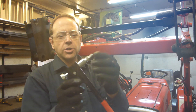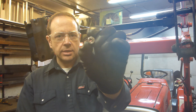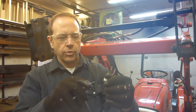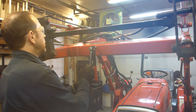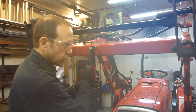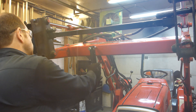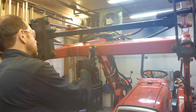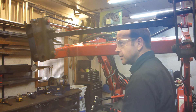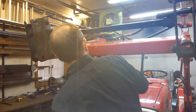For you to know, this is an insert — actually it's pretty much like a pop rivet, but there's threads inside. This is a quarter-inch, 20-thread. We're going to insert that in that hole. That's the first time I use that — I hope it works. It worked! It's squished in there, it's not going to come out. You can't move it now.